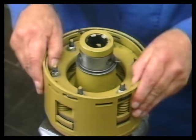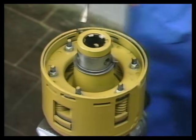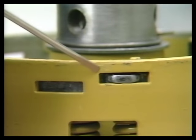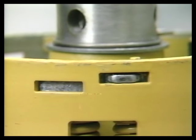Care should be taken to ensure that the adjusting ring accurately rests against the coupling housing and that it is assembled in the marked position. The torque may be changed by the adjusting ring and by two different assembly positions in the coupling housing.